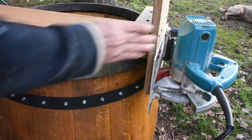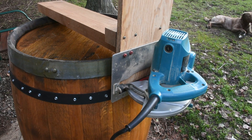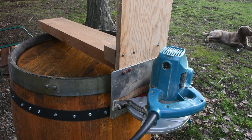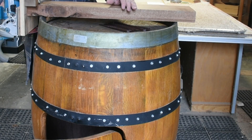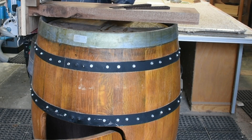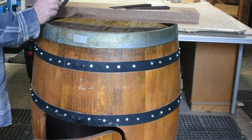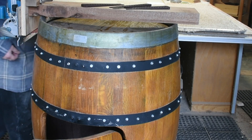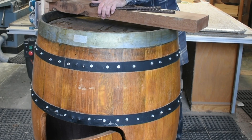We've got our jig on top of the barrel, which we'll use to cut off the top. You can see it's stable and lays across the barrel. I've got videos on the wine barrel jig if you want to build one. Here inside, I just have the jig on top. I sand the top with a mini grinder to take off any wood protruding above the rim — barrels can swell. You want the jig to run smooth all the way around. On the underside I've put a couple layers of packing tape so it glides along nicely.